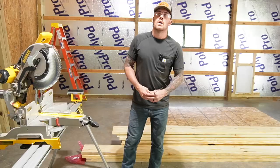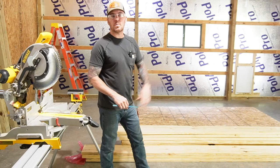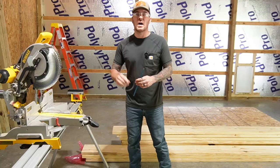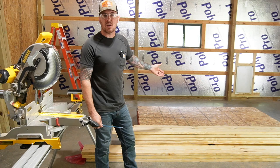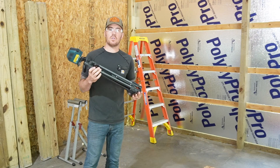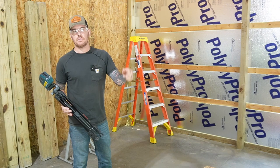We are back here on day two. Last night I went ahead and got all that foam insulation board finished up. I used the spray foam gun to foam all of the joints, and I like to use a hacksaw blade because it's flexible and it's got fine teeth on it — I go around and cut all of the excess foam out of those gaps to get it nice and flush with the wall. So today we're going to start sheeting. I got some 7/16th OSB and some 2x10s. When I put this OSB on the walls I'm going to be using this laser — it's really handy, I use it for all kinds of applications — to make sure everything is leveled up so everything goes together nice and square. I'll have links in the description.